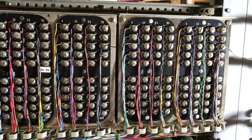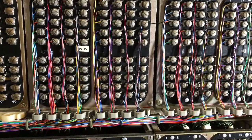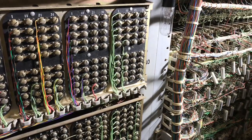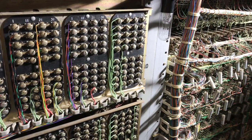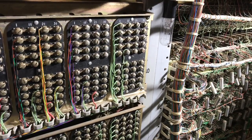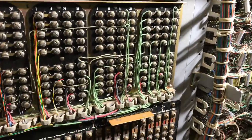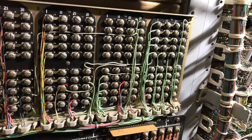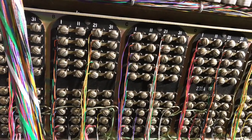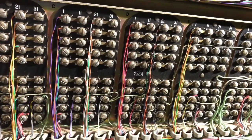Here is a completed view of the wiring on the two 235 KTUs. Here is the rear of a 239 KTU, which has some common leads that go to the interrupter for the lamps. The leads are connected to a 238 panel below, which I will show. Here is the common equipment side of the 238 panel. And here is the line equipment wiring for the common tip and ring that goes to the backboard — that would be the tip, ring, A, A1, LGL.